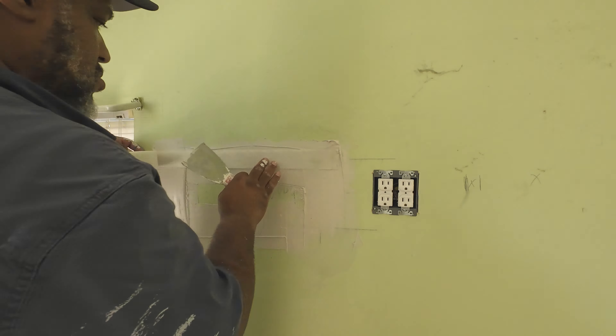It's not difficult. If you want to cut the drywall back to the studs every time and it makes you happy, do that — it's unnecessary as far as I'm concerned, but hey, I'm not the Oracle. Also keep in mind — this is just a PSA — when you run that wire through the wall, you have to keep it back at least an inch and a quarter from the front of the stud. That's a minimum, because when you put your drywall in and use drywall screws and things of that nature, they won't hit that wire. If you can't do that, then you've got to put metal plates in the front.